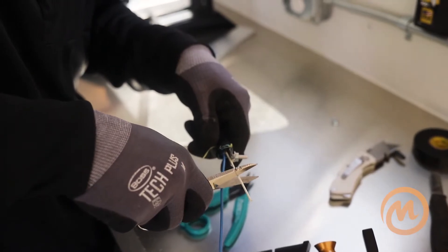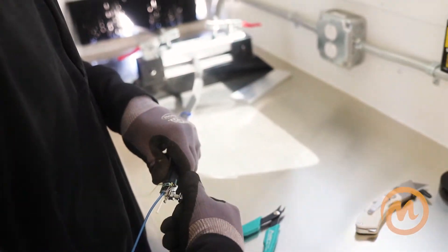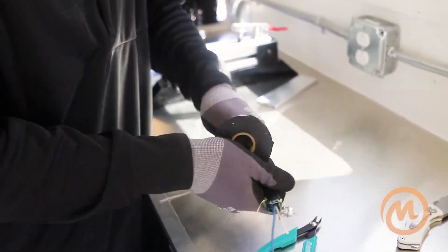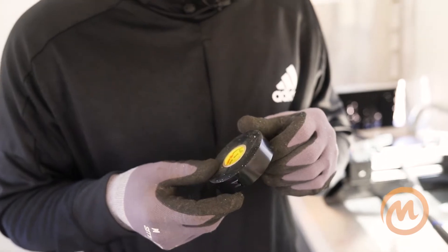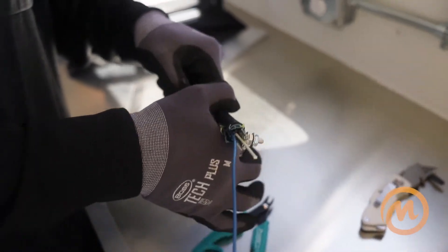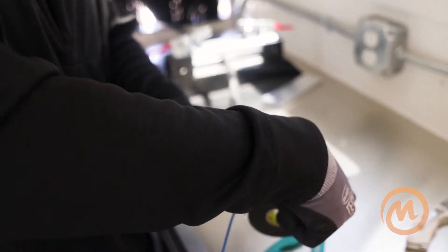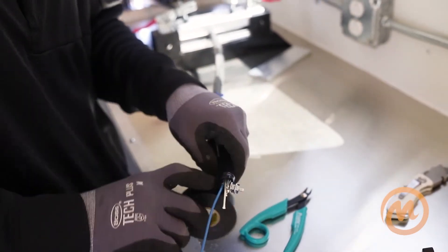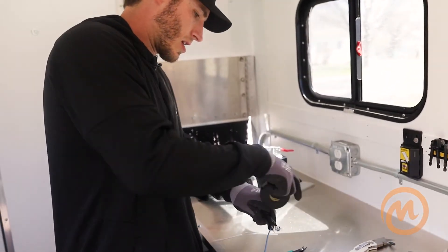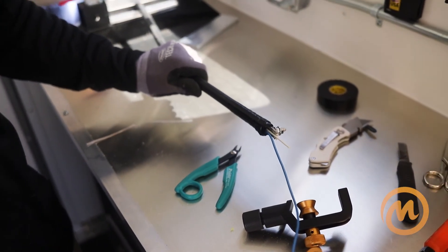Based on experience, I'm going to cut this at about an inch and a half. Next we tape this up — you can use whatever tape you like. We like using Scotch 3M Super 33 or 88; in this case this was cheaper. I always start about an inch from where I made the cut and go all the way up to the base, going around four times, then make my way down. And that is a prepped fiber cable.